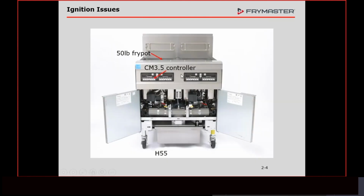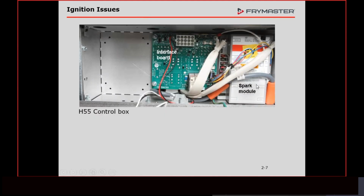All right, some of the other components that we have. If we were to lower the controller, we're going to need a 6-in-1 screwdriver to do that. We have some Phillips head screws underneath here. That's on the current one. The older style, we had a couple different bezels, 3 that I know of. Once you lower the bezel down with the Phillips head screws, behind here we're going to have 2 1/4-inch self-tapping screws that we have to take out. Once you drop that down, this is what you're going to find.